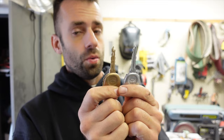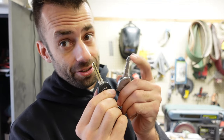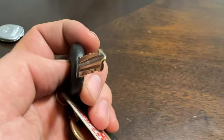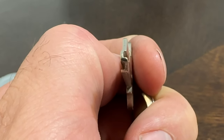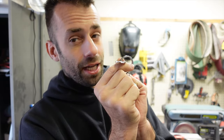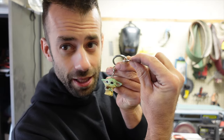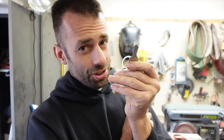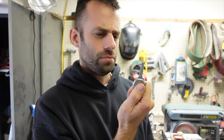The house keys have all been failures. We got close with a few truck keys, and one of them actually kind of works — I can open the truck but I can't start it. My truck key is a little thicker, which makes it easier to cast, and the bevels cut in there actually have a release angle so the sand doesn't get trapped. With the house key the bevels are 90 degrees, so once sand is packed in there it just wants to tear apart. I couldn't get the sand to pull away cleanly on any of them. House key: total failure. Truck key: half failure, half success. Now the challenge belongs to you — show me how it's done. Thanks for watching, bye bye.